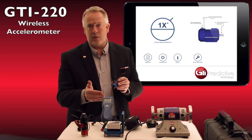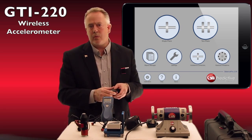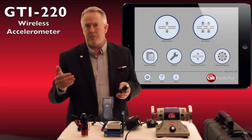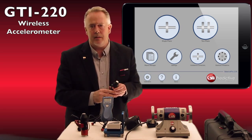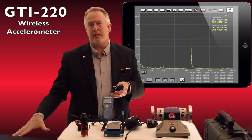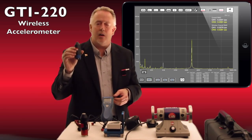By using the tachometer on channel two of the wireless, we can now wirelessly balance any industrial device — fans, pumps, motors, spindles — anything that would require field balancing, whether for in-house balancing of repair items. And when we get close to heavy industrial equipment, it's much nicer to be able to step up to 200 feet away and take readings, make measurements, and make adjustments. Channel two can also be used for a second accelerometer for phase or to take two readings simultaneously, and all this streams spectrums completely live so we can look at them in real time, not just a snapshot. That is, for 2015, our new wireless accelerometer.